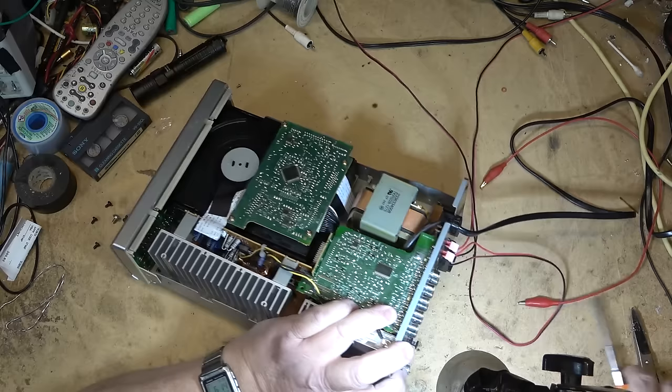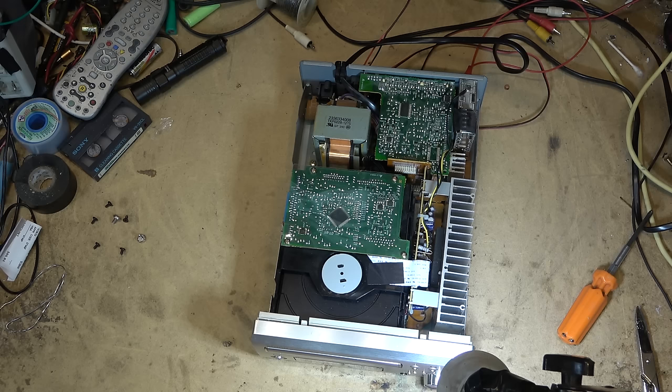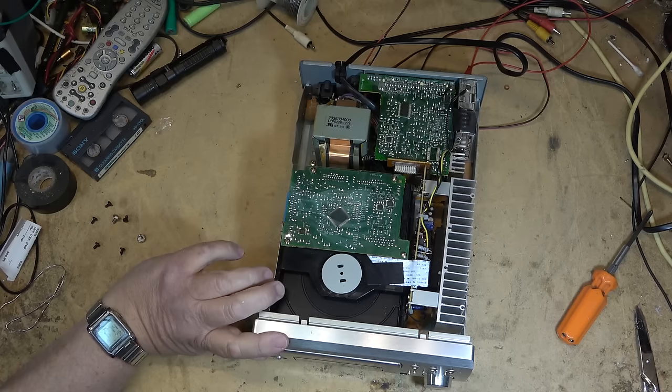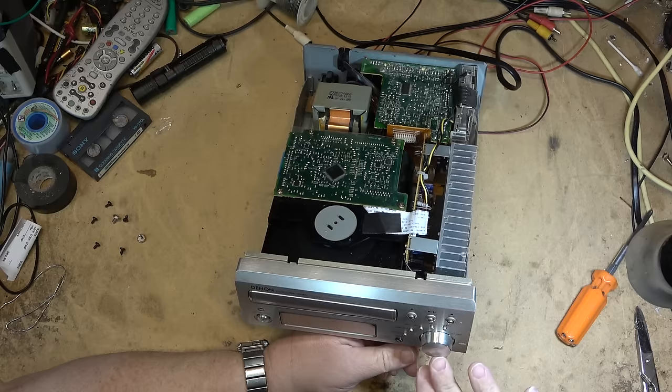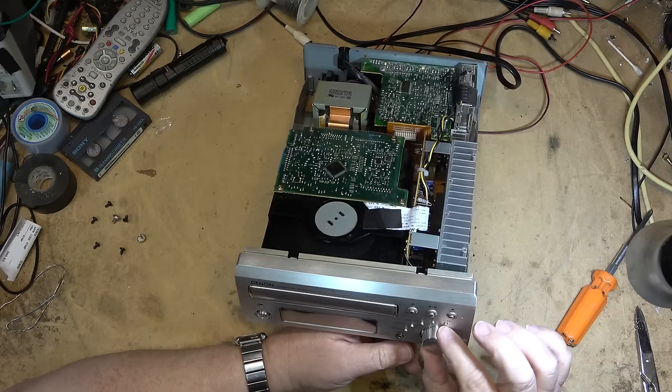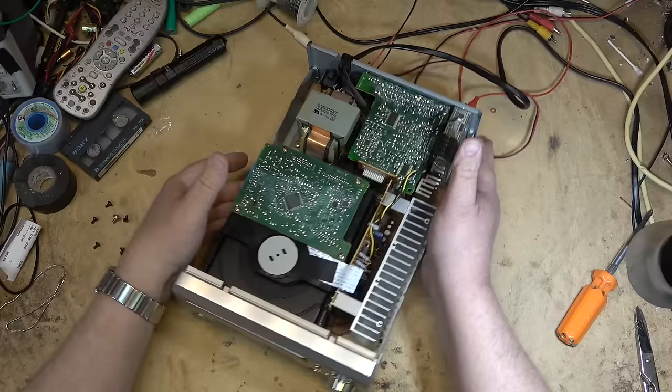See if this thing gives me any more volume than it did before. It could very well be that the IC is cooked. I got that problem fixed, but the volume control is kind of screwed — I'm turning it down and it goes up. So the volume control encoder needs to also be cleaned. I fixed one problem. That's all the connections — piece of shit.